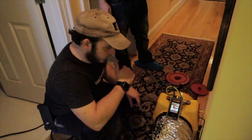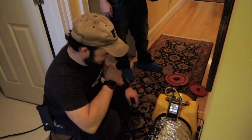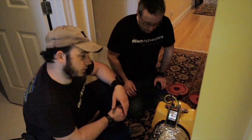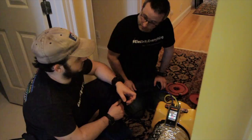We were right at zero, and then it tried to modulate up, and it went to 1.2, and now it's trying to drop back down again. Okay, so I see we have like 133 CFM of leakage. What is that of total system flow? The 131 is comparative to about two 5- or 6-inch ducts. Okay. And it's a 3.5-ton system pushing 1,400 CFM nominal.